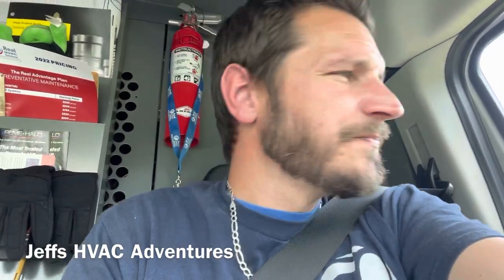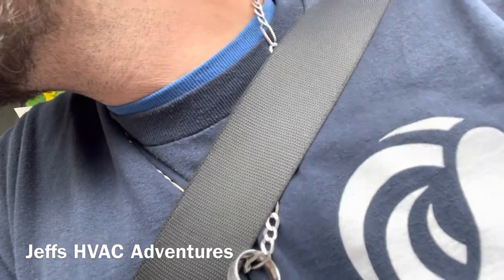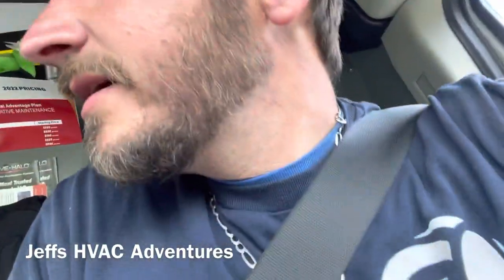All right, guys, how about that? A little low voltage short there. We found it on that. It was actually the high pressure switch wire. Just trying to back out of the driveway here. Yeah, high pressure switch wire.